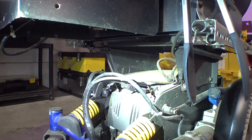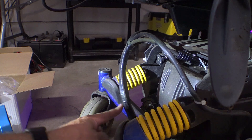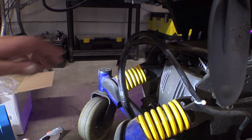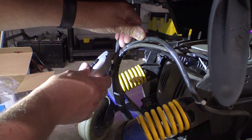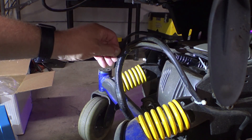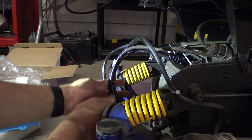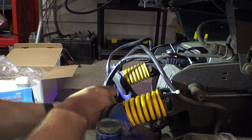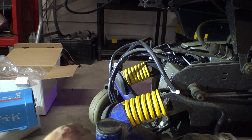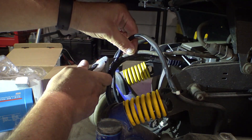This system is never going to see more than 40 amps at full load, which explains why the terminals aren't super huge. We've got plenty of space to mount that inverter. Man, this thing is dusty - I should probably clean it. Looks like I used electrical tape to cover everything. Let me see if I can remove the electrical tape without flaying my finger this time. I believe we were working on the Bounder last time I used this knife, and yeah, it kind of sprung a leak. We're trying to pull out our main battery connection cable, then tap into that, add a 40-amp automatic circuit breaker, and solder in some wires to power the inverter.